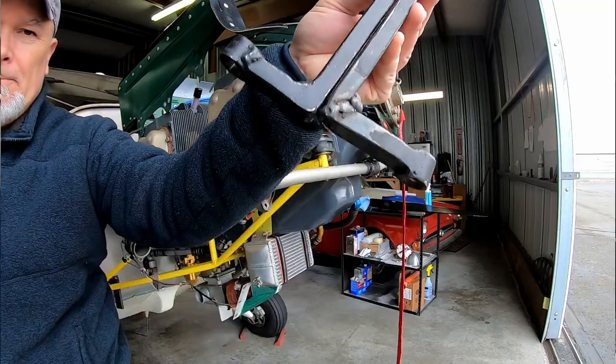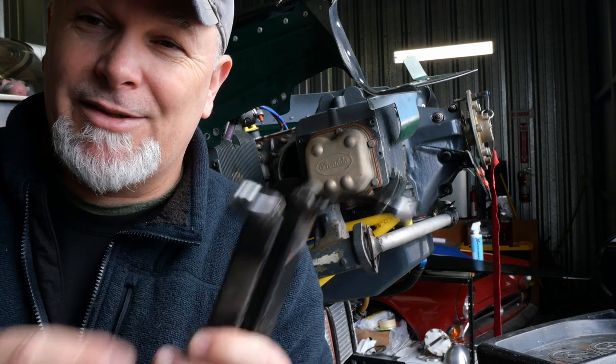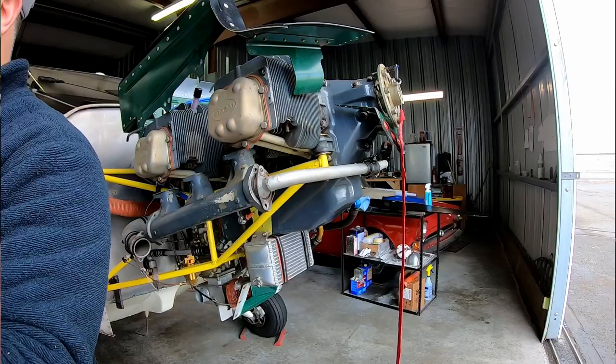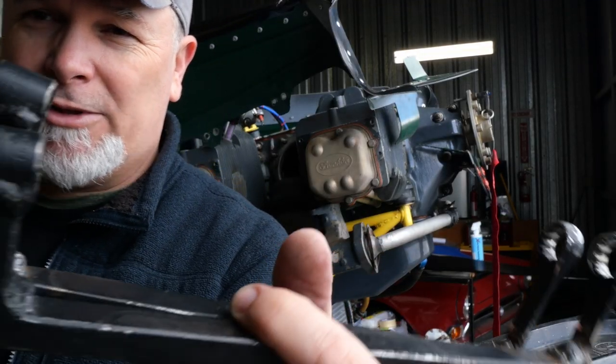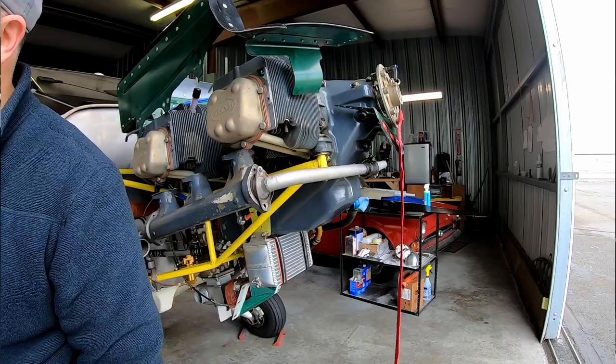I don't know of anybody that sells these. I was able to make my own. I just sacrificed a 5/8 and a 9/16, put them on a bar stock, and then took some old sockets and welded them on all together to make my wrenches. I'm not the best welder, but find a welding buddy. That's my best advice.